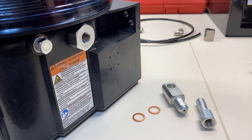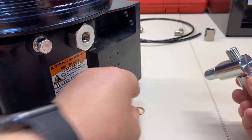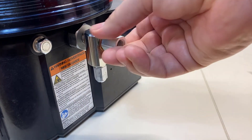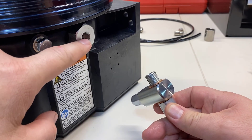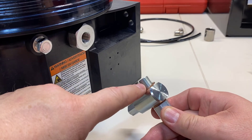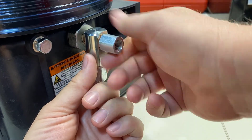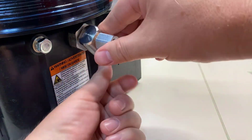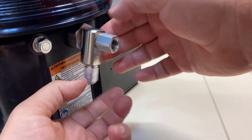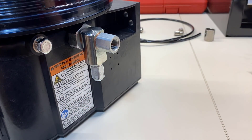You're going to need your banjo bolt at this point. What I typically do is put one of the rings on the banjo bolt, slide the banjo fitting on, put on the other ring, and then thread this in. The thread here is an NPSF thread, which is a straight thread — it's compatible with NPT male fittings as well as the NPSF straight fitting. Because we have an NPSF male it's not going to bottom out since it's all straight thread. One of the main reasons we use the banjo is so that you can point this relief valve in any direction — typically you want it to point down so it's not going to hit somebody and will just squirt down and accumulate a little pile there.